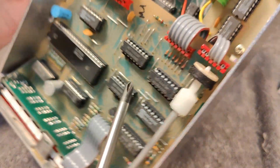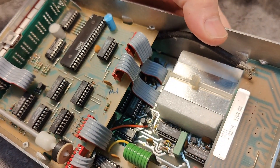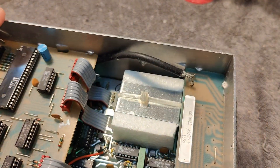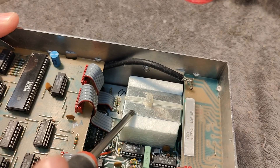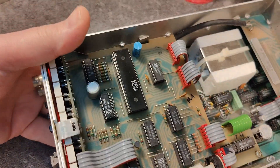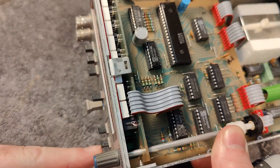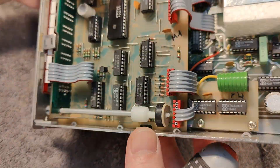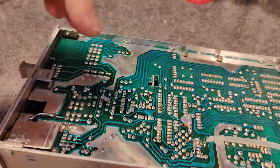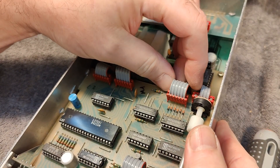We also got timebase stuff going on down here — all those dividers, counters, and logic. In here is most likely a little oven, or maybe just an isolated crystal oscillator. I think we should try and open this one and see what we can figure out about all those loose connections. I don't think it's all from the switches, because when I push the switches I also move around on the circuit board. We can see all the connectors and cables are connected here and then go into those sockets — this is just a classic loose connection type of socket.